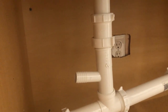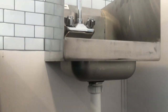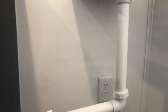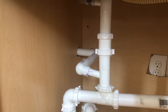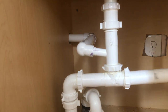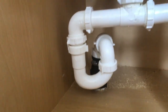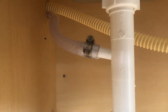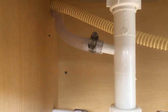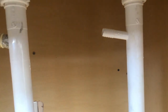The next section will be running these other hoses and then hopefully getting the running water lines put in. We're done with the drains — I've done many tests running water through each sink and each hose to check for leaks. At first I had a leak down in the trap, but I put some compound on it and it's been working great since. I've also added the clear hose for the rinser and another hose for the espresso machine, with a spare spout for future use that I need to plug for now.